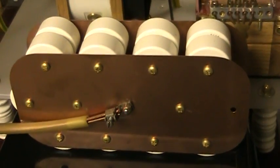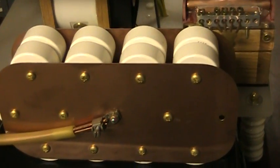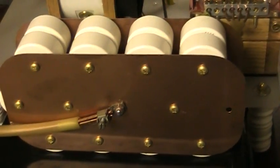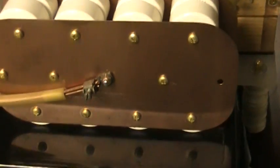See it's pretty tight but there is still spacing between the edges of the tubes and the sides. Here's my capacitor bank — doorknobs of course. The capacitance is slightly larger than resonant, which is .0084 is what I'm running now.